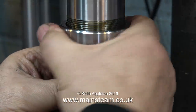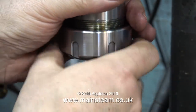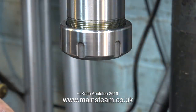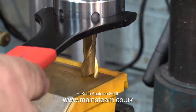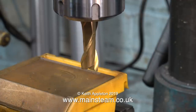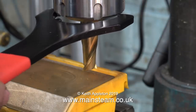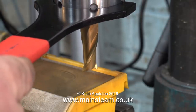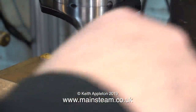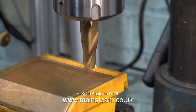Time now for test number two. I've fitted a much larger collet into the chuck, and I've also fitted a much larger slot drill. Fitting this larger slot drill was a bit more difficult — it kept falling out. But all was well when I rested the cutter on a plastic box while I tightened the collet ring. What I don't understand is that as I tighten the collet ring by hand, it suddenly starts to stiffen up about a third of the way, and that isn't holding the cutter — that's why it fell out. Then once I apply the spanner I can tighten it all the way, so I don't know why it starts to tighten so prematurely.